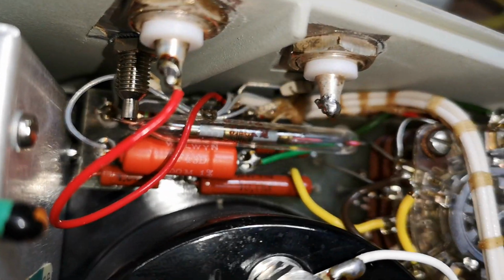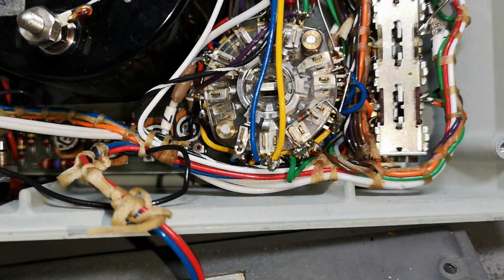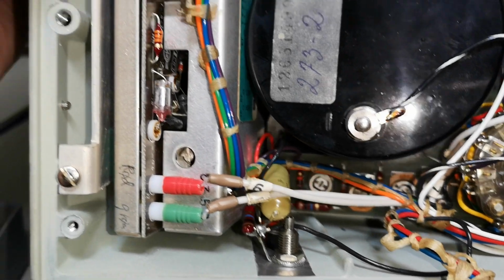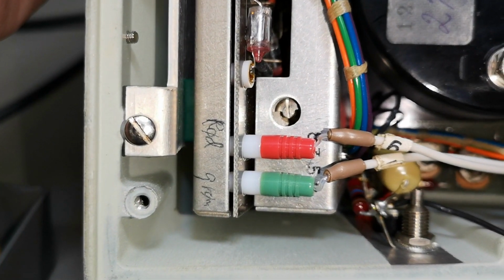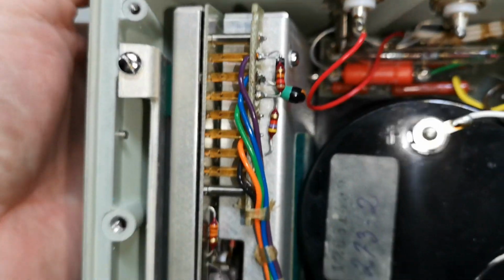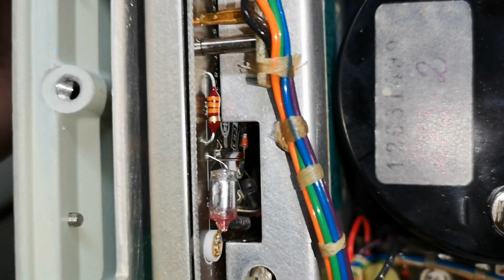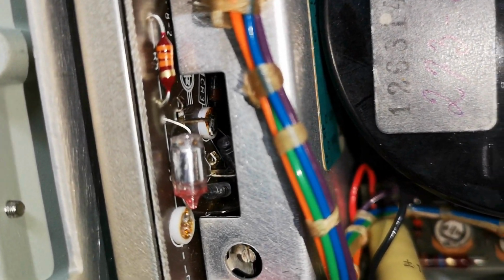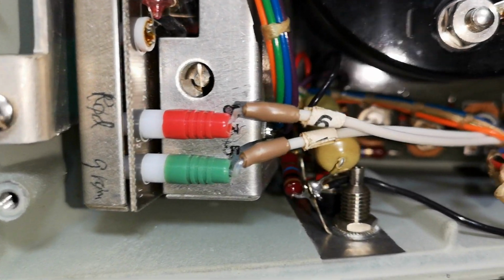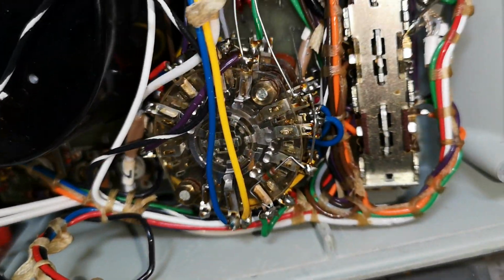Oh, look at the shielded cables in Teflon. Ooh, ultra low leakage stuff. Isn't that just nice? And we got red and green written in Danish. Isn't that just sexy? So there's a shielded electronics board in there with, ooh, this appeared to be some Teflon. Yep, some Teflon isolators and some stuff on this PCB. Again, shielded Teflon cables all the way on all the critical stuff.